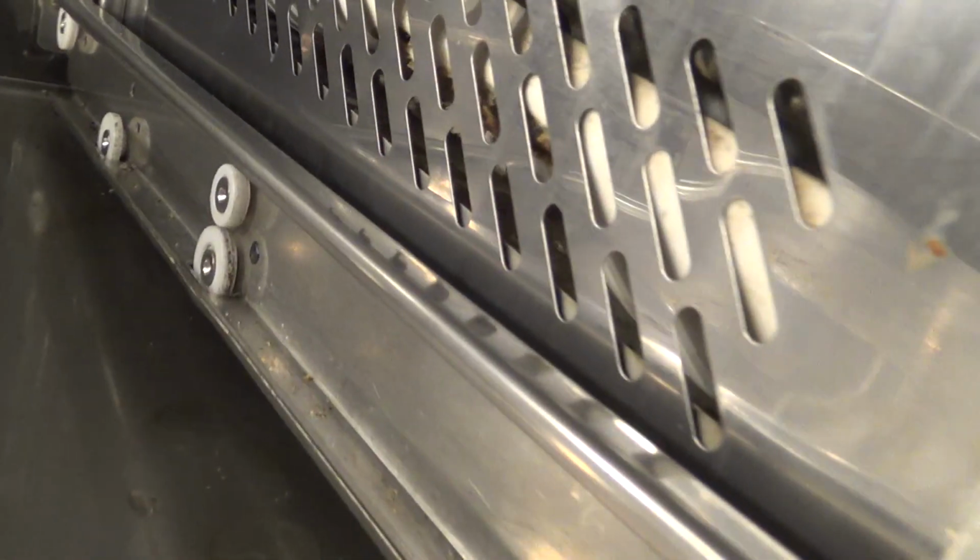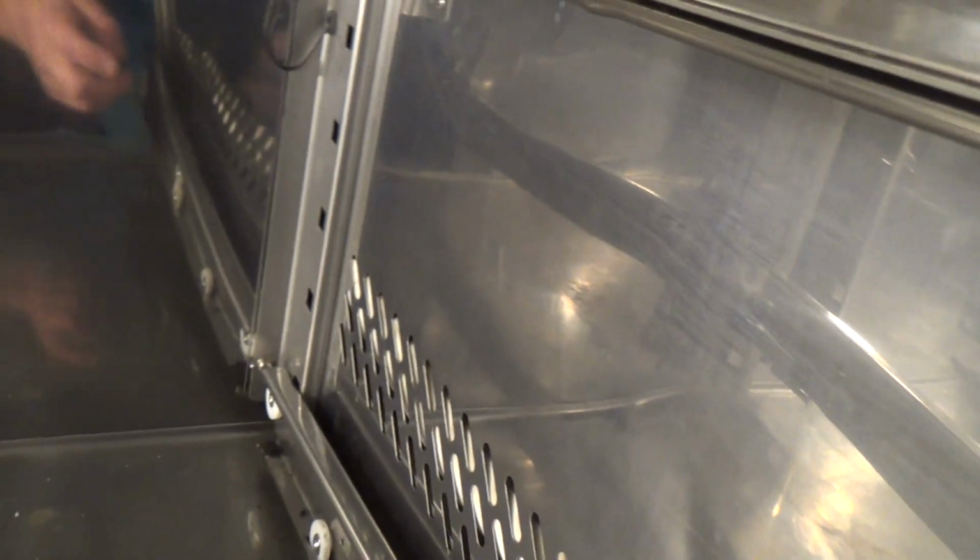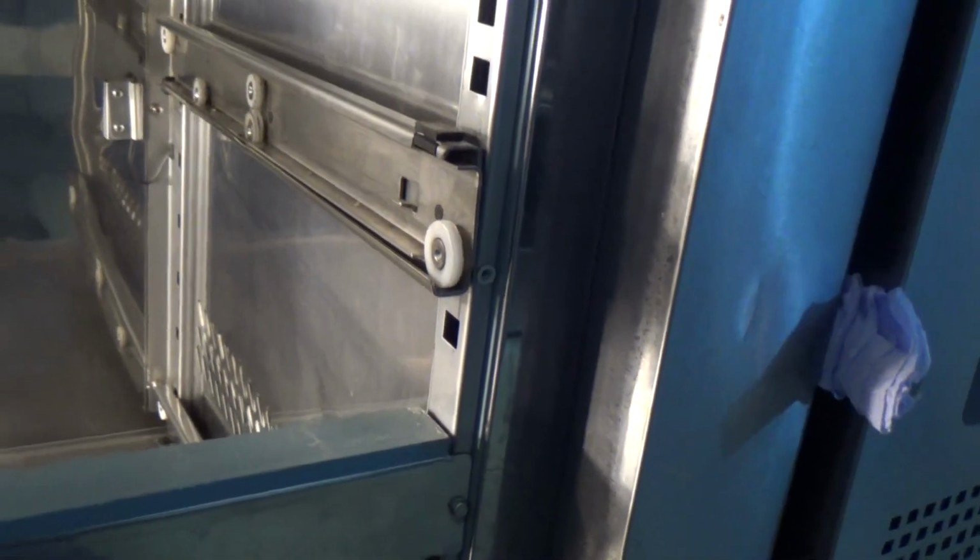Two up the top. I think there might be some down the bottom. And then you can see through there, that white piece is foam insulation. It's supposed to be stuck to the side here, inside, to stop the airflow getting in between the coil and the sheet, but they always fall off. Well, it's quite common, and it drops down and blocks the airflow up. Anyway, get all this taken apart.